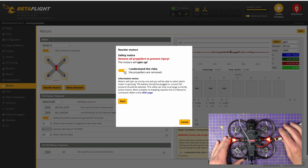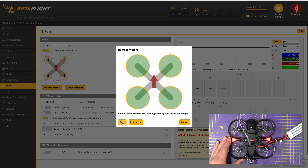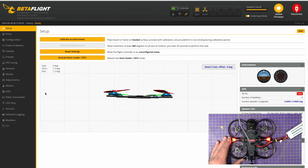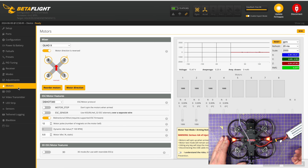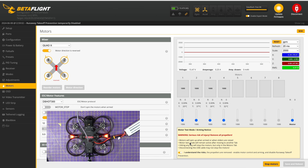All it does — you hit start, and you simply have to click on the graphic to say which motor is pulsing. In this case it's this one down here, so we click that one. It may be a different one for you because it's wrong. So that's motor 2, that's motor 3, and that's motor 4. We now save that and reconnect. Go back into motors, and the way to check this — again, you should be doing this with the props off — come down to the motors tab, if you just pick motor 1, you can use the sliders gently and see motor 1 is turning. You can do the same for each motor to make sure that those match what is shown on the graphic. Very simple.